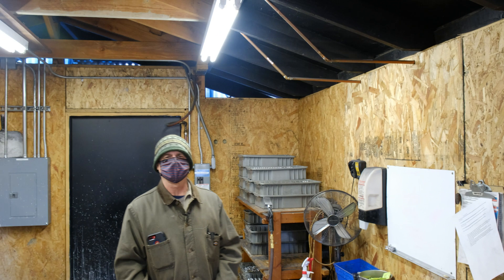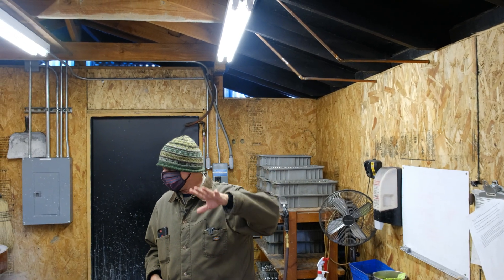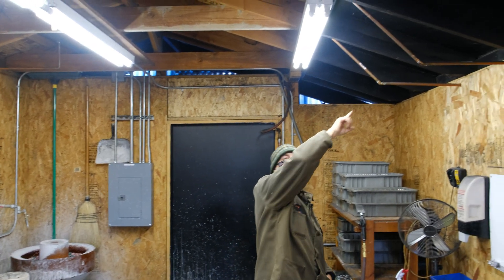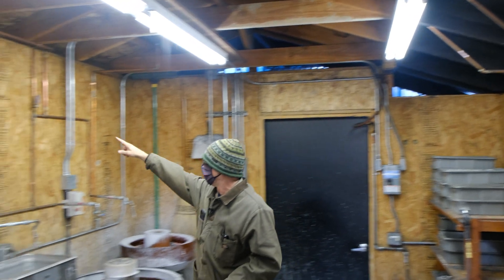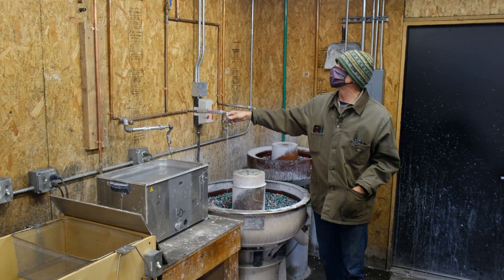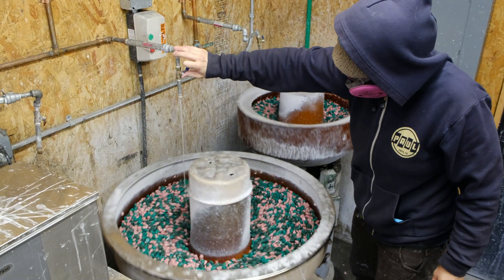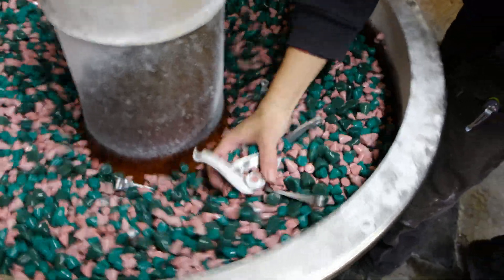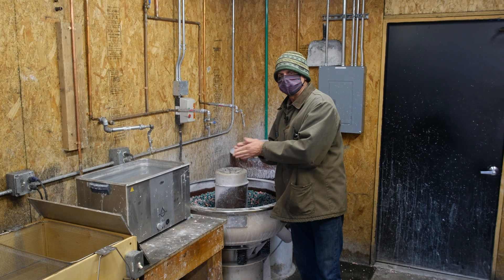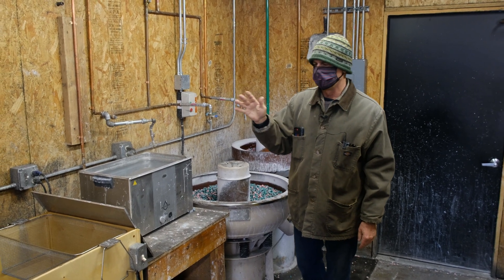This is the tumbling slash finishing room. Here we've got our copper pipes coming in from outside. This room is notoriously dirty, but it's being kept nice and tidy. The water, gravity fed, comes from that tank through here down to here and feeds these tumblers. The water comes out automatically and feeds another tumbler over there. As these things go, the water helps flush the effluent or the swarf out, because these media rub on the parts and actually grind — so you've got some super fine grit in there, fine grains of both the plastic wearing down and the aluminum being ground off. Not a lot, but it does pile up.